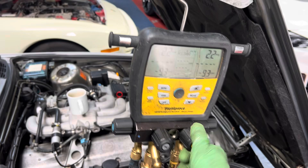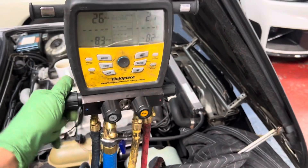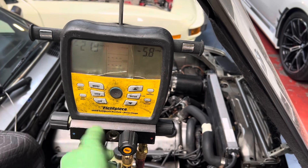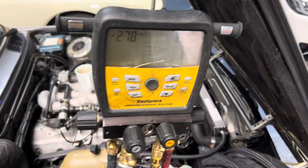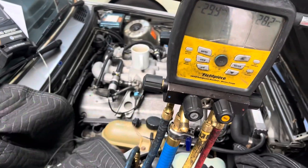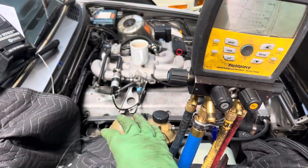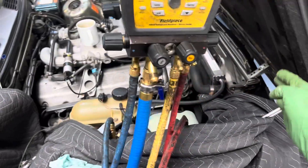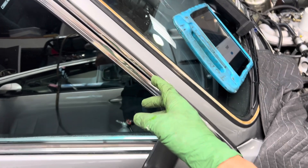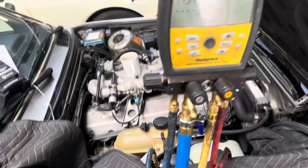This will be the last time. I'm changing this over to R12 anyway — went up to 2 psi. This is just so I can change it — getting all that other gas out of there, because it had R134a and that stuff is soaked down into the oil. Normally you'd have your engine going, heating up the compressor, the condenser, all the lines — in defrost, in heat mode — heating up the evaporator with hot air going over it to help speed up the moisture removal.